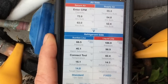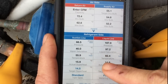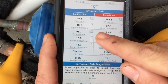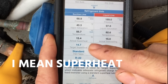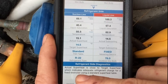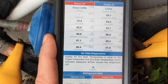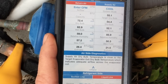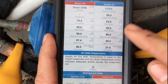Let's stabilize and see where we're at. We now have a 40-degree saturation inside our evaporator and our superheat is 15.6 with a target of 14.7 — that's definitely within range. The diagnostics at the bottom read: actual superheat is close to target superheat, which indicates adequate refrigerant charge. Looking inside at our two psychrometers: return dry bulb 72, wet bulb 62. The diagnostic reads supply air dry bulb temperature is close to the evaporator exit target. That is how you dial in your superheat.